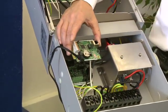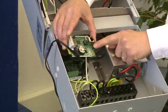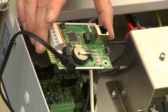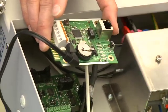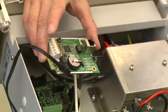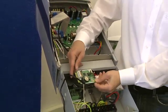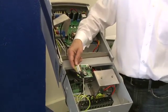The card is doing a single blink — that's the comm light. The link light is not on and the act light is not doing anything. The comm light blinking three times means communication is pending, indicating no internet and no link connection to the router. If a cable is almost correctly wired but one pair is twisted, the link light may show but the comm light will still blink, meaning you need to check your wiring.